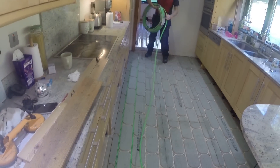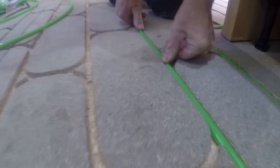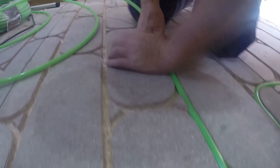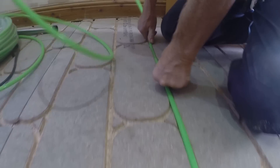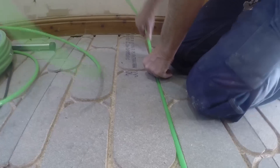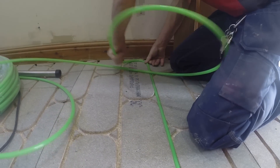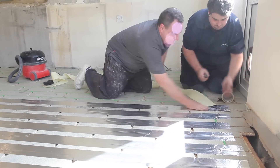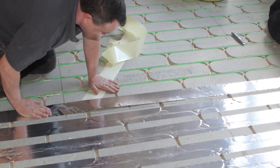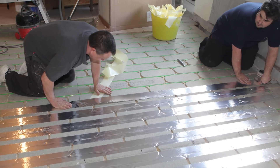So, Timoleon. The Timoleon system uses chipboard which is CNC routed out. The pipe is an interference fit — once it sits inside that groove it's held captive because the groove is slightly undercut so it retains the pipe. If you routed out a piece of chipboard yourself and tried to achieve this you wouldn't manage it because the pipe would keep popping out. Once you've laid the pipe into those chipboard panels you then stick a heat diffuser silver foil tape over the top, and that spreads the heat out so you get more contact with the floor surface.